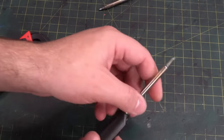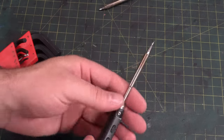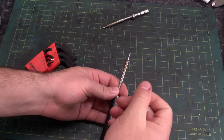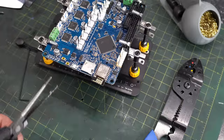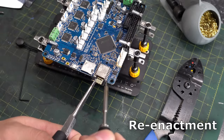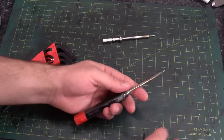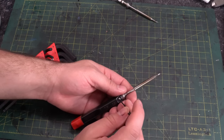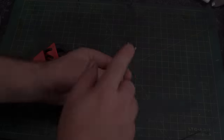A while ago I picked up this other tip — I don't know what it's specifically called, but it's like a pointed conical tip that's curved. I found this tip is actually really good for PCB work. Recently I had to desolder a WiFi module off a Duet and move it to another Duet, and this tip came in very handy. The BC-2 tip though is pretty good for most general use you're doing with 3D printing. If you're looking for something more precise, there are plenty of other tips out there. Replacement tips aren't too expensive, and depending on the soldering iron you can buy kits with multiple tips. Use the right tip for the job.